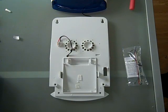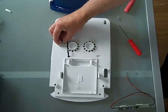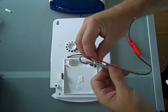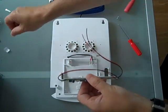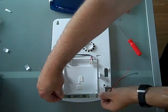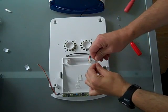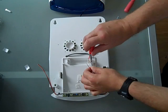The final part of the demonstration is the hex LED A. The hex LED A requires the power terminal to be removed from the original point to a push-on similar to the hex LED B. Just remove the film from the sticky pads. Ensure that it is the correct way up and stick in place. Taking the wires closest to the label, just feed those into the terminal block.